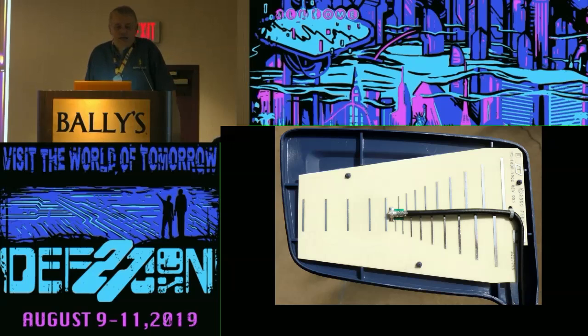Here's another technique: a log periodic feeding into a Yagi. You can't add additional reflector elements, but you can add additional director elements. This was used for basically a 2 to 6 GHz log periodic, and they've added director elements at 6 GHz. That gives it a little more gain, a little more directionality up at the 6 GHz area. Allowing for losses in the coax, you probably come out about even.